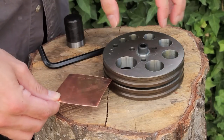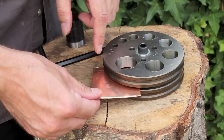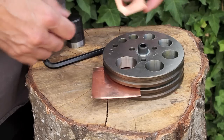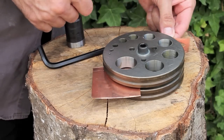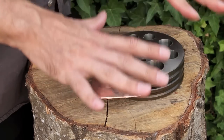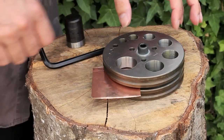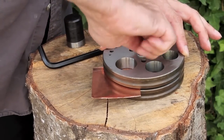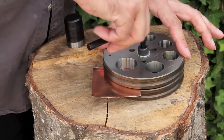So, 0.5mm copper — I'm going to use the big hole and line it up. Try to be economical and cut near the edges so you'll get more shapes out. I'm also taking a little off-cut of the same material and popping it in the other side — that just helps to keep the top plate balanced and nice and level. It's not a necessity but it's always good practice. Tighten it up finger tight first and then just a little bit, just a fraction of a turn.